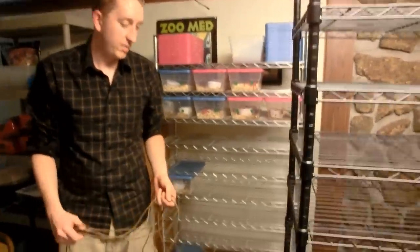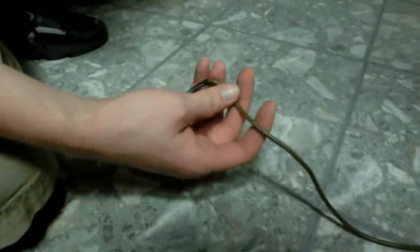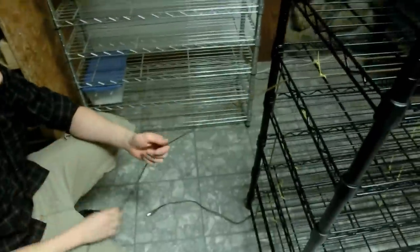We're about halfway here with the rest of the cable still to string up. Right here there's just a little black mark — this is kind of key. This black mark determines where the heat starts on the heat cable. To the left of it is where the plug is and it won't get warm. Once that black mark starts, that's where the heat goes. You want to align that dot right where the heat starts, then begin going up. You can see the zip ties as we go — we'll trim all that off. We're halfway right now and we'll show you the finished product in a minute.